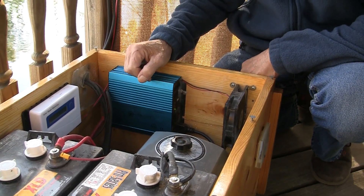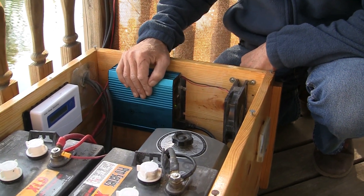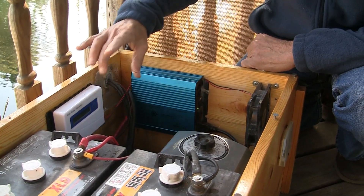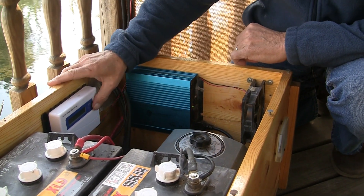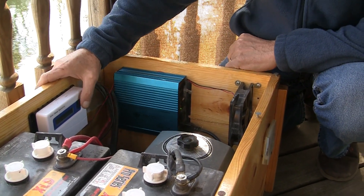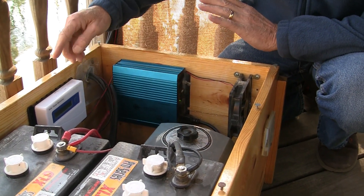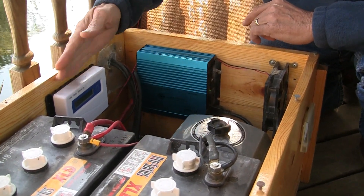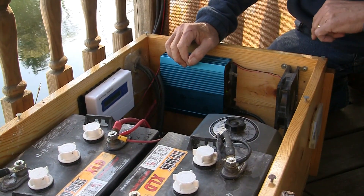Now the fan's on, keeps it cool in there, and the inverter hasn't shut down since. Then come fall, just punch the button and it's off. That little black controller I had on there — I didn't like it, it's kind of unreliable, and it didn't have an on/off switch for the DC output. I love these controllers; never had one fail, ever. These things are fantastic, and this black plate on the back side is a heat sink, and it is warm right now.